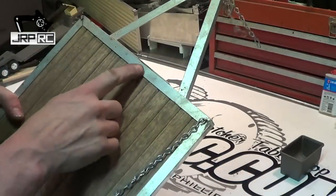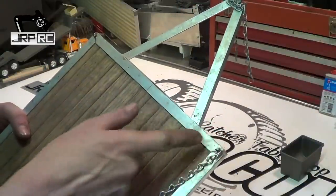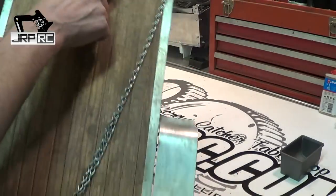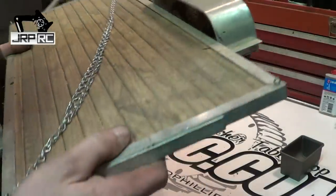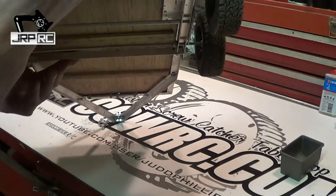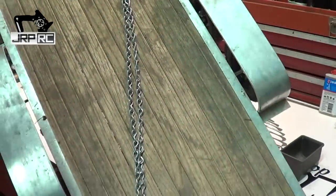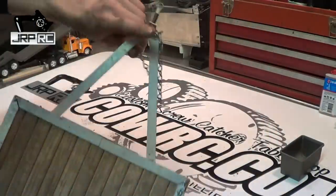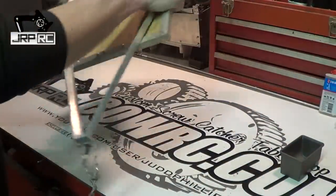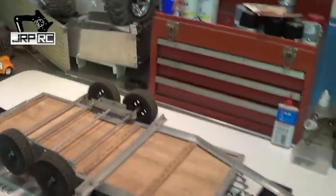And can't forget safety chains. To make the main frame, I took the half-inch channel and cut a 90-degree notch in it, then bent it to a 90-degree bend and made two halves. I connected the halves with a piece of half-inch angle with some screws through the bottom. There are no visible screws on the top except for these guys up at the very top of the trailer. Now we'll take a look underneath — I'll take the camera off the tripod so it's a little easier to get a good look at it.